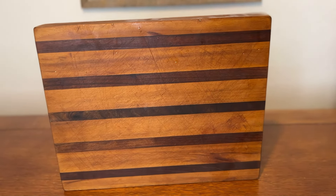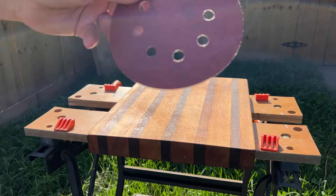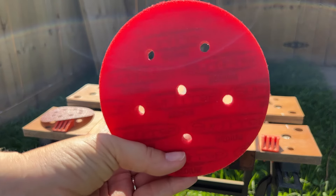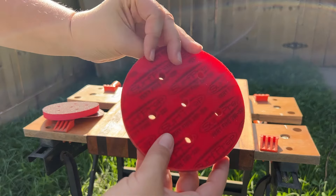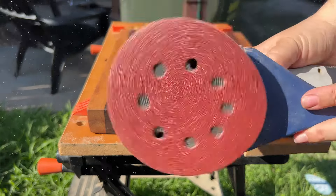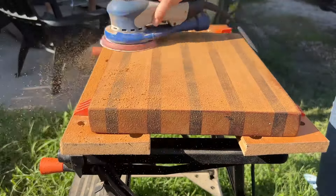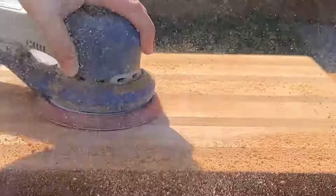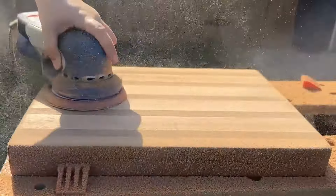Someone donated this piece to Goodwill because they had given up on it. You need to know that is not what you should do — don't give up on these pieces. I will show you exactly how to fix them. I'm going to use the same technique I would if I was refinishing a dresser that had scratches all over it: start with a low grit and move to a high grit slowly. There are so many scratches in this piece, so it is going to need a long time of sanding. If you have a planer you may run your cutting board through it, but I do not have one so we're just going to continue sanding.